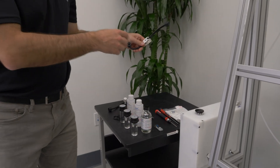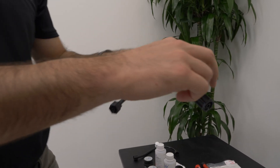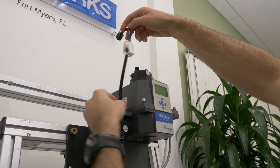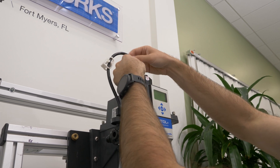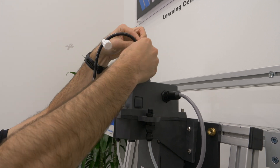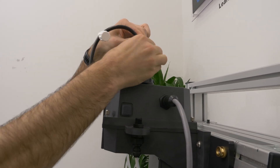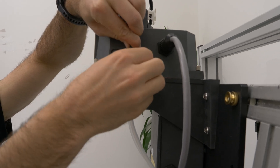Open the tubing kit provided with the analyzer. On the inlet side, the side with the regulator, connect the tube with the shutoff valve using the threaded fitting and then to the inlet port on the top of the flow head. On the outlet side, connect the tube with the back pressure valve to the outlet of the flow head and the top of the quick connect fitting for the drain.